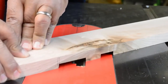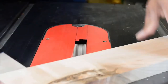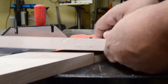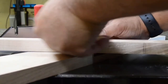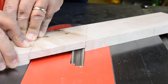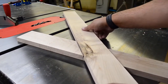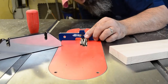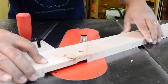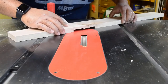Once I'm satisfied with these initial passes, I'll then start nibbling away at the rest of the remaining material. Now before moving on to the next leg, I need to check the fit — in this situation, it's still just a pinch too tight, so it's back over to the dado stack for a very careful extra pass to widen the gap. Once the fit is good, I simply repeat the process on the mating piece. The next step is to raise the stack to the final height, then it's time to repeat the process all over again, including sneaking up on that matching existing shoulder — and did I mention that there are more accurate and easily repeatable ways to achieve this? Maybe I'll do that next time.